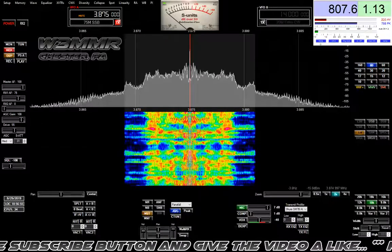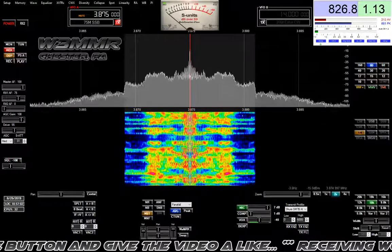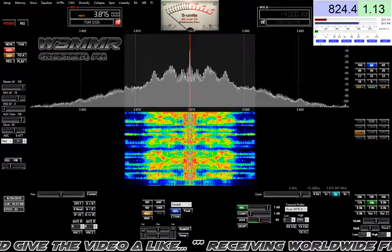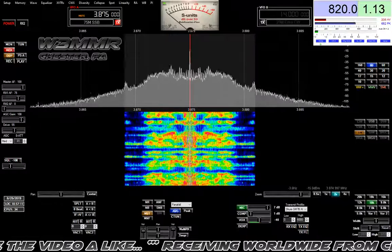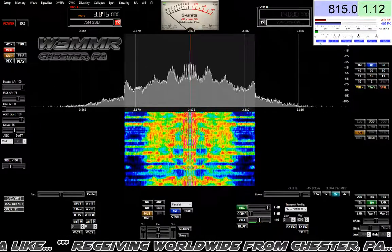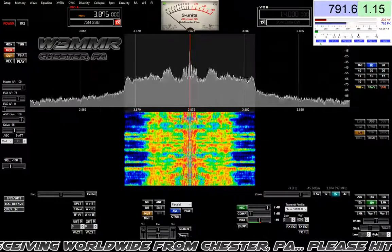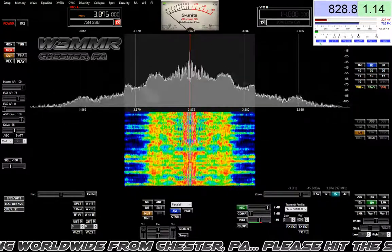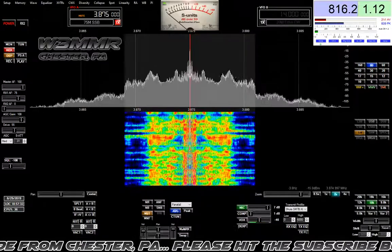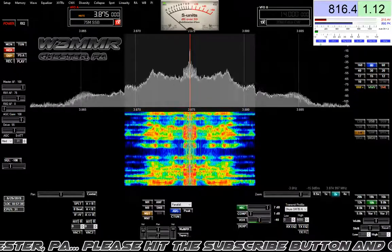The only problem is I'm getting a little RF in the shack on 20 meters. It makes my LP500 go wacky when I'm tuning up at full power, when it's throwing basically a 1100 watt carrier. Once I turn the drive up past like 700 watts on the watt meter, the watt meter starts going back down the opposite way instead of going up. I've got two other meters though, on the tuner and on the amplifier, the AL80B there. It shows that I'm still putting out full power, but like I said, the LP500 is showing I'm doing like 100 watts.